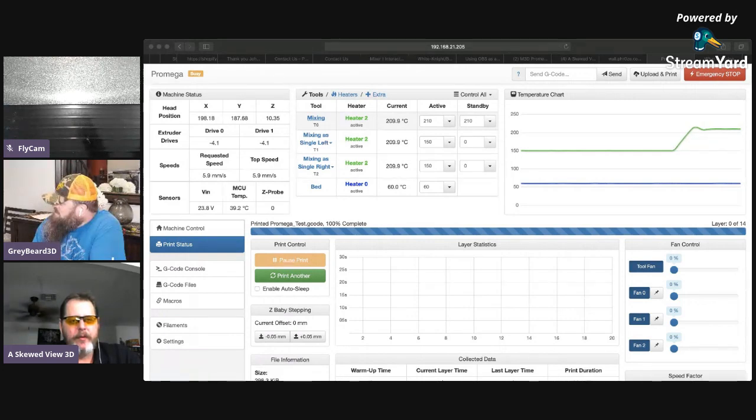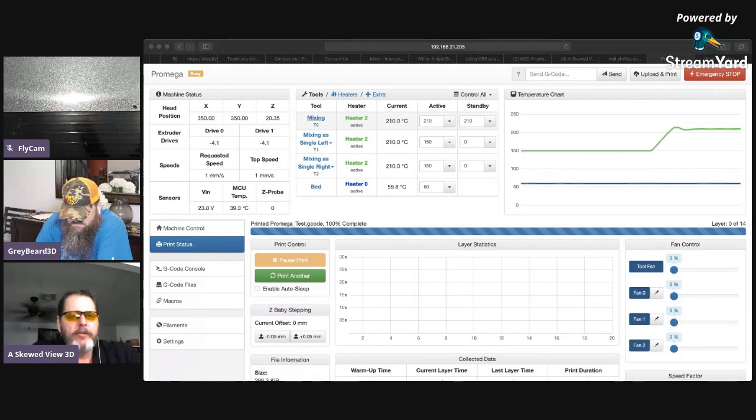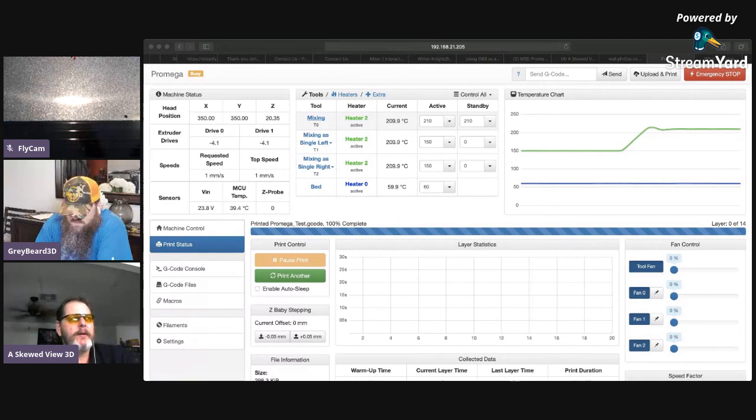Check all your plugs. Something's got to be loose. They're plugged in. I don't think anything's loose. I think something in that start G-code told the printer to start crawling. Well, maybe you should have just printed our design, Turkey. Just saying. In the start G-code, they move the platform down 15. Where do they move it back up? What does the platform moving have to do with the speed? That's a whole other thing, right? What is F200? If they move the platform down, that explains why the filament didn't grab, but still, that was really slow.